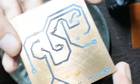As you do this, check if you have a perfect PCB circuit by putting a light source below the board and checking if the light passes through the rest of the board while leaving the path of the circuit. Once this is achieved, congratulations — you've done it! Now take some thinner or petrol, or grab a piece of dishwasher scrubber, and start rubbing the surface of the etched part. You'll start seeing the golden copper traces appear. Your PCB is now completed.